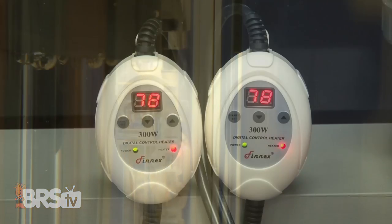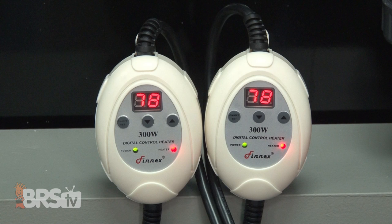And so there is a right answer, and the right answer is how much did each one of these things cost. If I know for sure that turning one of these things on and off a million times a year is going to wear it out, and one that almost never turns on and off, has very few duty cycles, is going to last a really long time, which one would I like to wear out first? My $300 EB8 outlet or my $50 heater? $50 heaters. So we learned the hard way here.